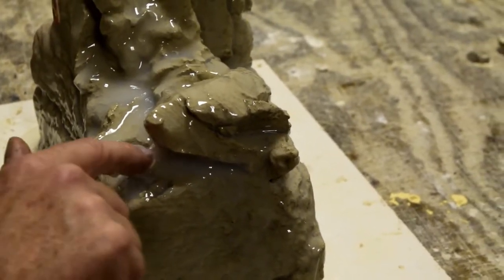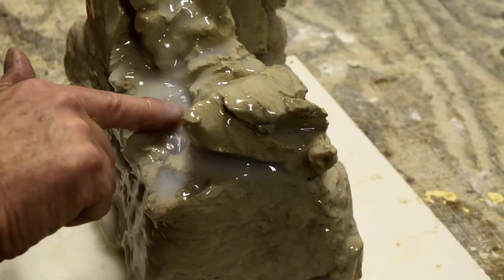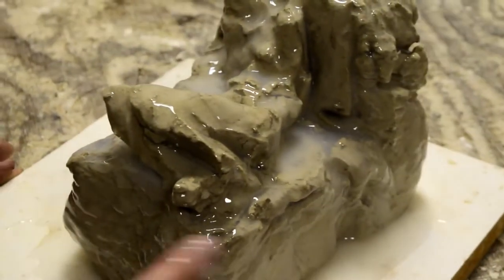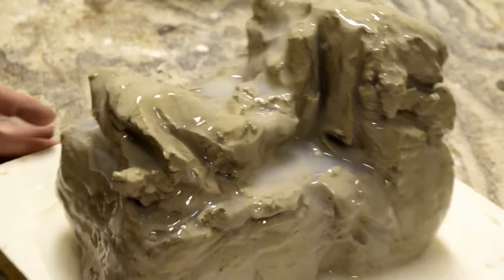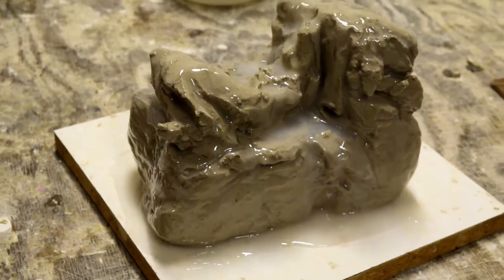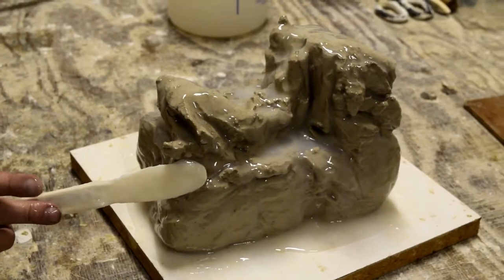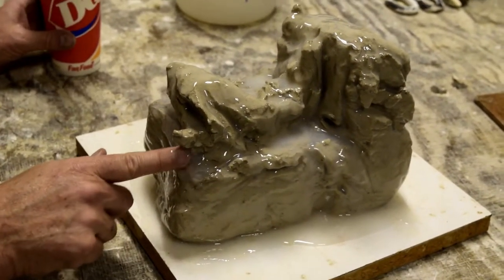Once this rubber jacket cures, a plaster or fiberglass mother mold is created over the top to give rigidity to the soft rubber liner. The rubber liner collects the detail and peels off of the sculpture, yielding a beautiful wax that should be nearly identical to the original.